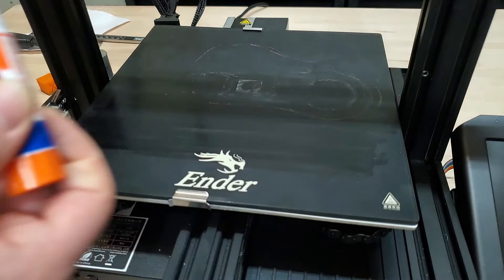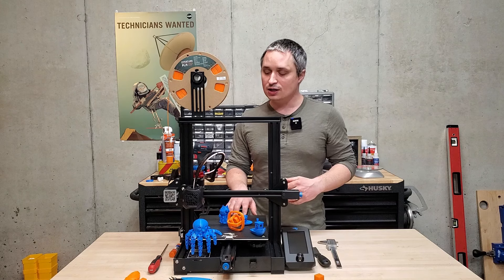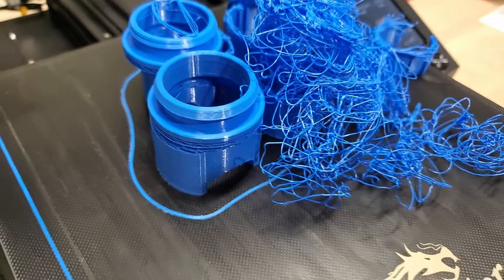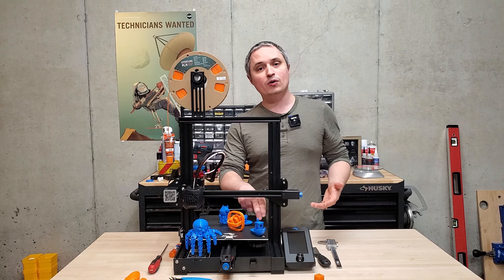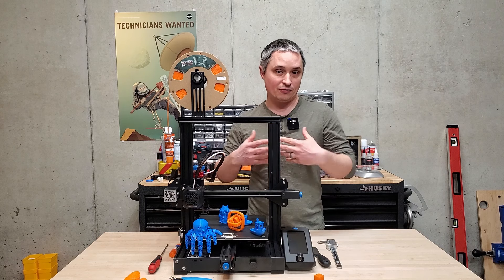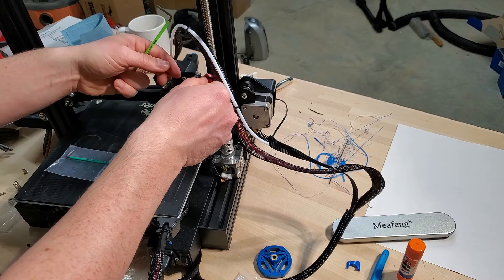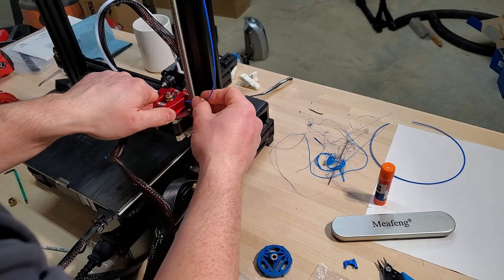After I got that glue stick trick figured out, it was smooth sailing until about 50 hours of printing, when I started having some extrusion issues. The middle of one of my prints was under-extruded and wasn't adhering, and then I started having problems with it not extruding at all on the first layer. I figured it was the extruder skipping and not feeding right, took it apart, and sure enough there was a cracked part on the plastic for the stock extruder. An all-aluminum extruder was a super cheap replacement, and I haven't had any problems feeding since.